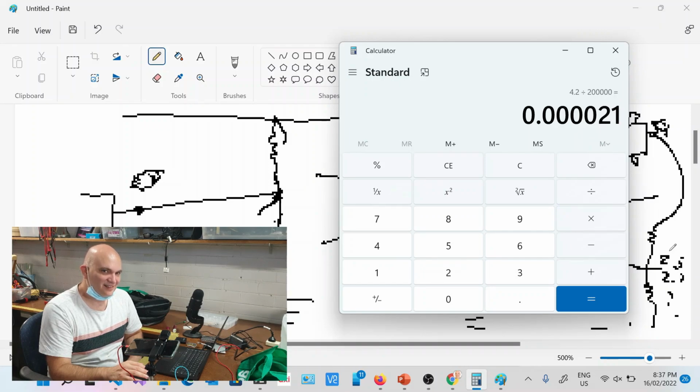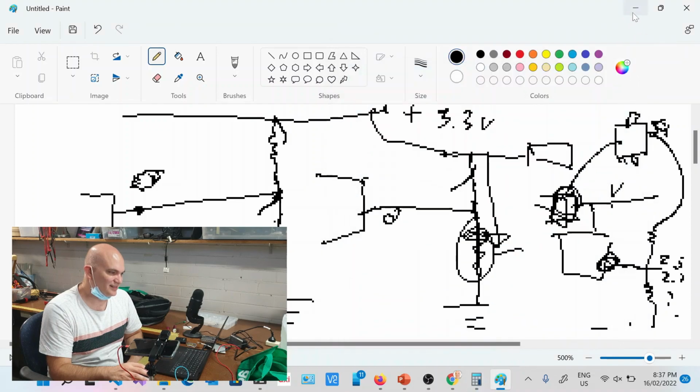Yeah. It's just not enough to actually drive it. You get to a point where it's sort of flaky on the edge, but I don't know what that point is. I don't know either. But I think we were using two 100Ks, and that's essentially the penalty we were paying, 21 microamps, which is not too bad. To be honest, the best way to answer these questions is actually just play with some resistors and see what happens.